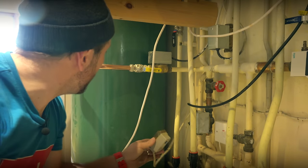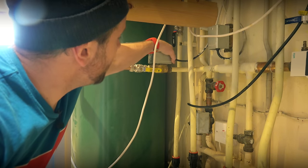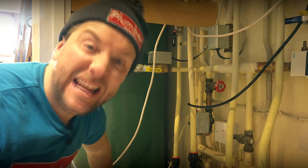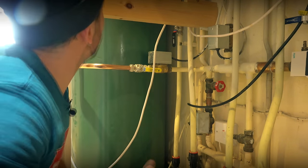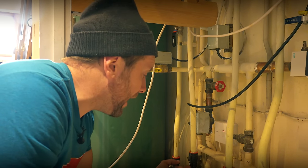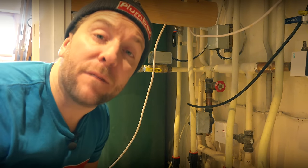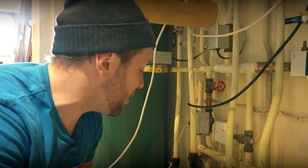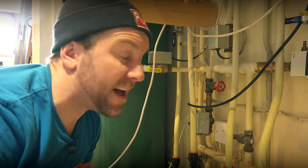Now I've got all the pipework done, I've got this two-port valve open, both these valves open, and we're now actually heating the water back up again. Tested for leaks — we've got no leaks. We do have a couple of weeps on this little pump here, caused by the fact that we've been moving pipework when we did the job. That's one we'll have to come back to — we need some new flexies for that in 22 mil.